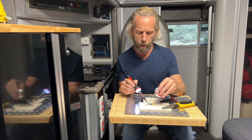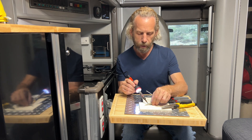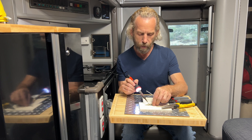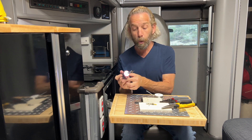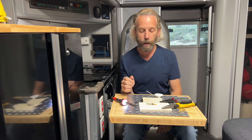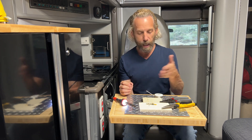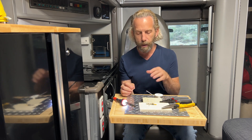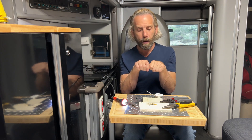You heat it up a little bit and add a little more solder. It really doesn't take a lot of solder to do this. You've got a big roll here, but you're not going to use a whole lot of it. You don't want it to drip over. So I just let it cool off, and then when I'm done I'll put these little rubber guys on there — slide them on — I'll show you how to do that. It's really straightforward. It takes you essentially five minutes per bulb. If you had 10 of them laid out here, you can kind of get this done really quickly. You prep the little pins, get them crimped and get them ready to go on there, and you're good to go.